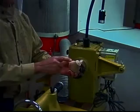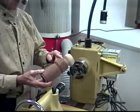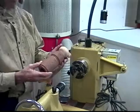And then to drive it, I use a piece of scrap wood, made a little 1.5 inches diameter block that goes in the chuck that'll fit in there. Snug fit, clamp them up tight. Now you can turn both pieces at one time. Just snug them up a little bit. I recess this back a little farther. So when you go over the top, you want to bring that down right to the top edge in the center. If you don't get all the way down, it'll be flat where the cover sits, and you have a little flat shoulder showing. Nothing that'll hurt, but.